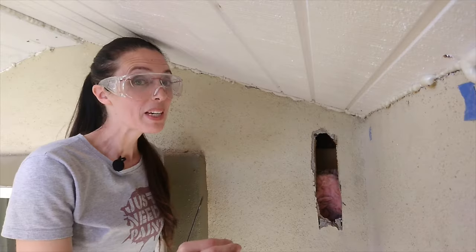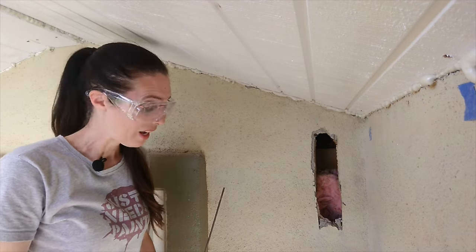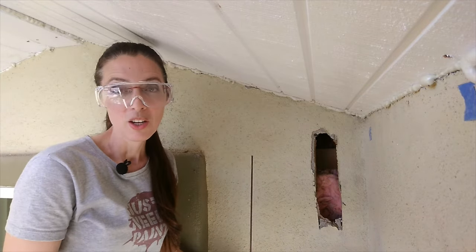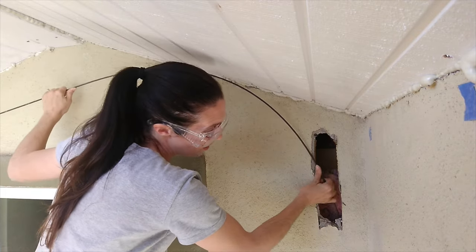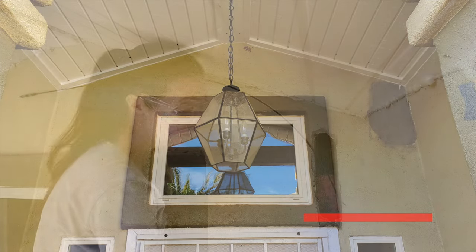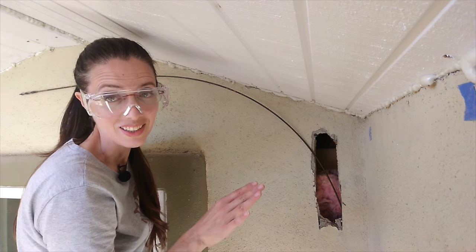Make sure you have enough space to work with. Our original hole didn't leave a lot of room, and space is always limited — we're never working in an ideal environment. With a 72-inch flexible drill bit it's huge. When we went through the drywall the first time, I asked my husband to make the hole bigger to guarantee success. I was able to fit my hand in and guide it down, and I could tell the trajectory of the flexible drill bit stayed along the outside rather than angling three and a half inches toward the interior.